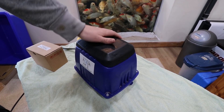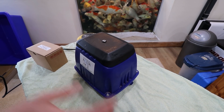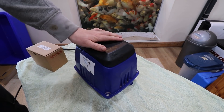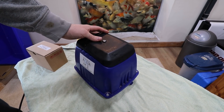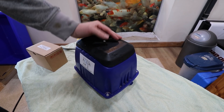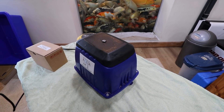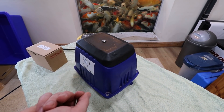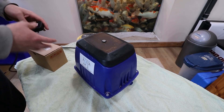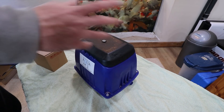This one needs a new diaphragm. I haven't ever changed any on my pond. This one I suspect needs changing because it's been a little bit neglected. When I took the lid off, the filtering was very mucky and I think the air had been turned off so it wasn't actually allowed to output any air at some point. So it was still running but the valve was closed on it, and that just killed the diaphragm in it.